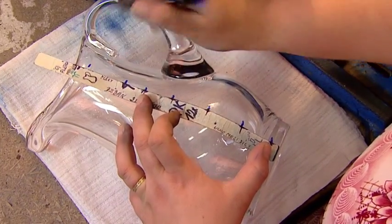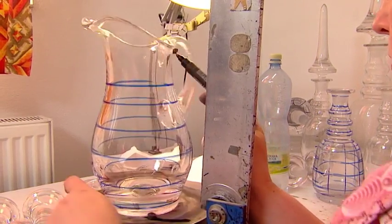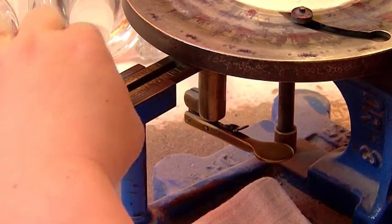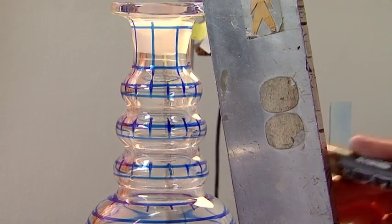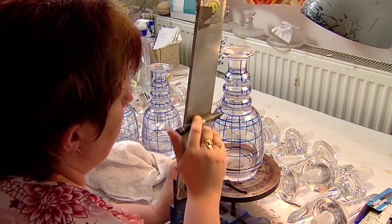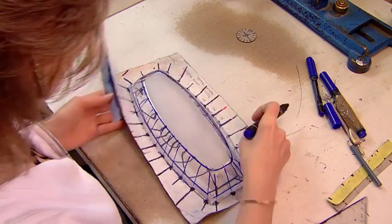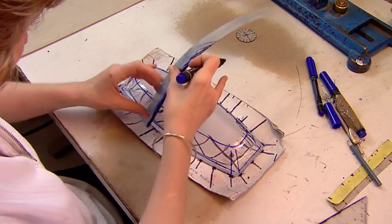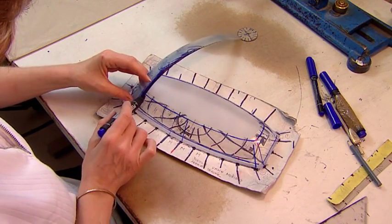Symmetrical products travel onto a division machine with a turnable device. This is where a simple and regular network of vertical and horizontal lines is made, which is used as a template by glass cutters to create the cuts. However, patterns for asymmetrical and irregular products such as baskets or angular bowls have to be drawn by hand.